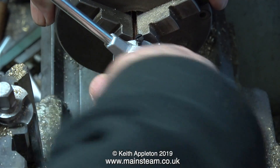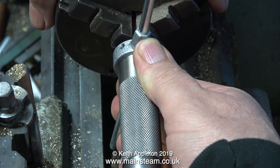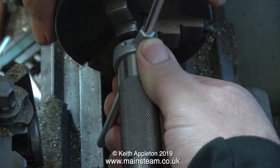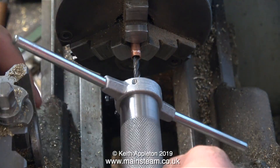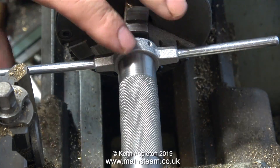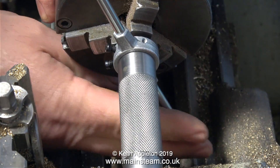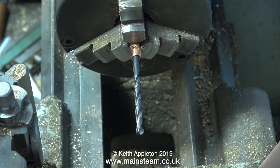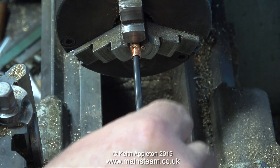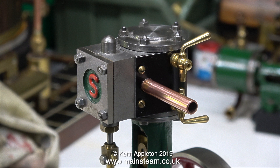The next part of the job is to make an exhaust pipe. I'm making this from a piece of quarter-inch diameter copper tubing with the shank of a twist drill pushed down the middle of the copper to keep it in line. And here I'm using my homemade tailstock die holder — I made this a while back and also produced a video showing how I made it. It's very useful because most of the popular sizes of die that I use are preloaded into the die stocks. And here's the finished exhaust pipe once I polished it up on the polishing spindle, and I think this looks ok.